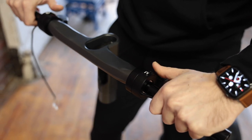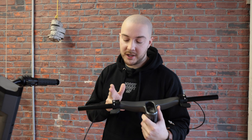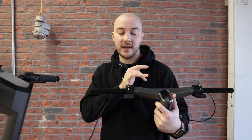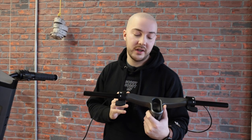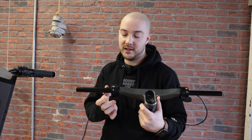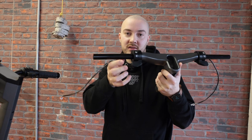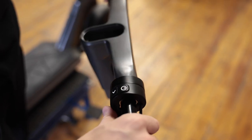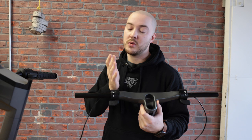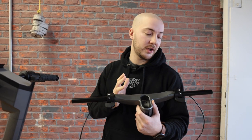With the City, we had problems with the throttle sticking because the spring inside wasn't ideal, and there was friction between the two moving parts. In our old mold, the tolerance for plastic molding was not up to our standard. On the new one, it's next level. This is a handmade 3D-printed sample just to confirm we like the shape and feel. The mold will be ready in five days, and that's what we're putting on the Pro. I'm really confident about these ones.